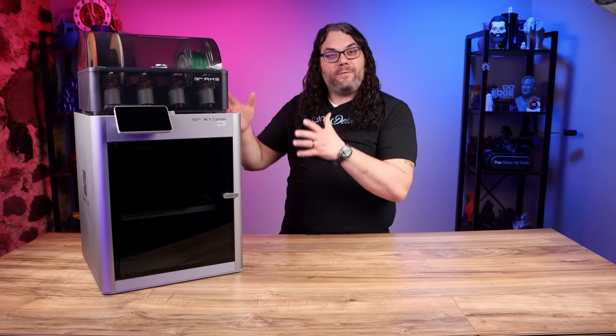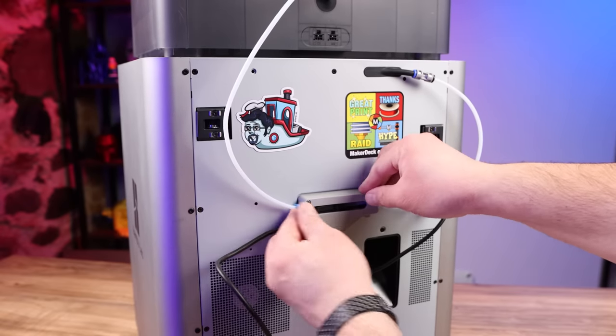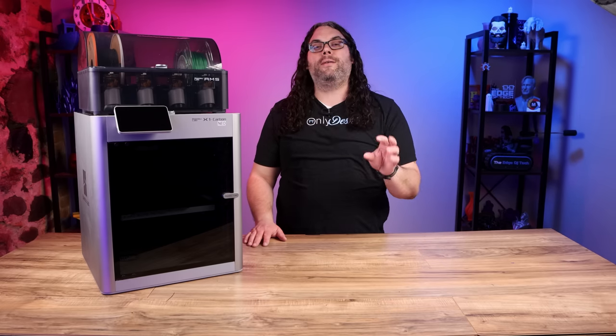Let's begin by removing the AMS from the top of the machine. You can do that by unplugging the little plug in the back and taking out the Bowden coupler. After we get the AMS off the top of the machine, we want to take the top glass off as well. The first two things we're going to do today is clean off our rods and check the belt tension on the printer. It's a good idea to do this once a month or if you get this error. We're going to start by turning your machine off — assume the machine will be off for the whole video unless told otherwise.